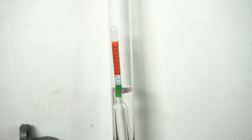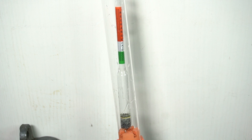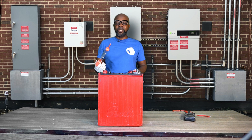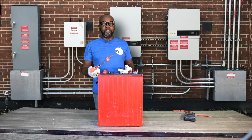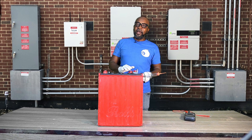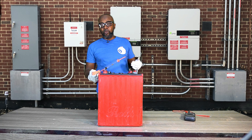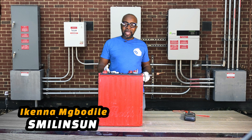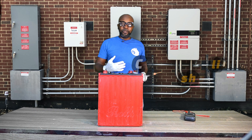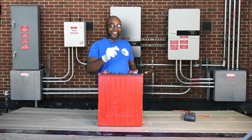To drain it, give the rubber ball a squeeze and it all drains right back. Anytime you want to test the health or true state of the battery, get yourself a hydrometer — it's a very inexpensive tool that tells you exactly what is going on, the true specific gravity of the battery. That's pretty much all we can cover today. My name is Ikenna from Smiling Sun — everything solar installation, everything inverter installation, everything going green. Don't forget to subscribe, comment, like. We appreciate all your support. See you guys in the next video.